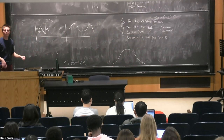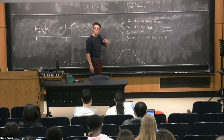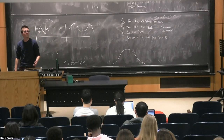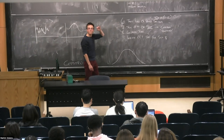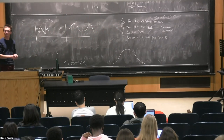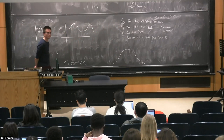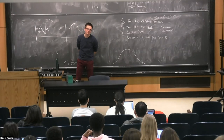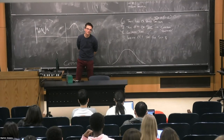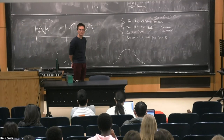This is all doable on the RP2040. Bruce has been experimenting with using this method to identify different vowel sounds — 'ah,' 'ee,' 'oh' — and you could use it to identify one person from another. This works specifically with voice because your throat produces about three to five dominant modes. I'm not sure it would work for instrument classification — I couldn't find any resources on it, though it would be interesting to find out.